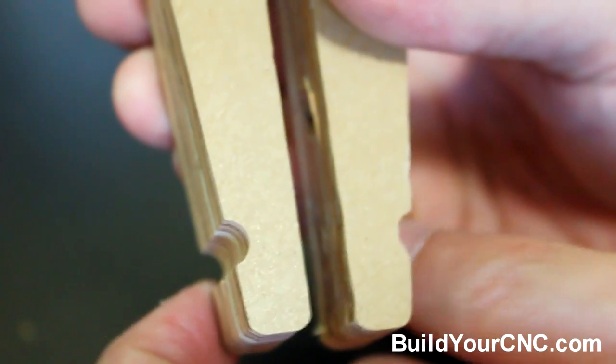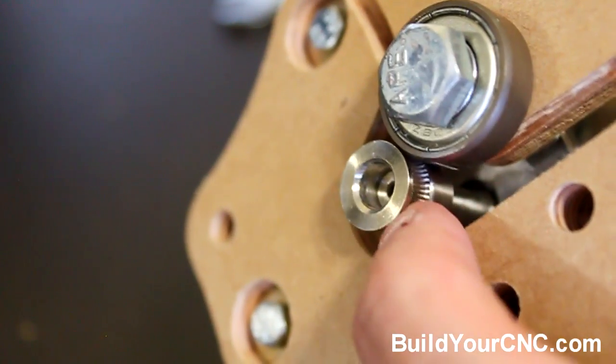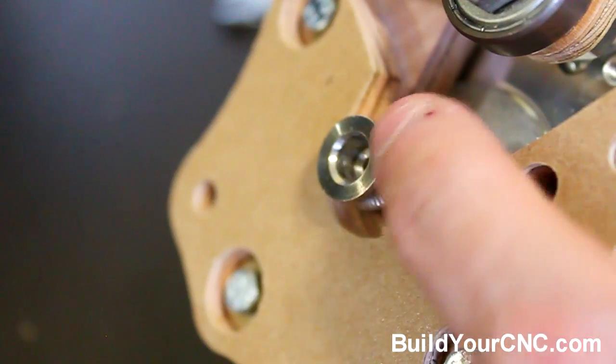This device will include these two depressed areas, or grooves, and that's used for a rubber band or some kind of tightening device. You can also drill a hole right in the middle all the way through both pieces and use a screw and nut to tighten them down if needed. A rubber band should be sufficient since it's located all the way to this end, giving a lot of torque or force between the bearing and the serrated hub. It's really only needed to grab the PLA or ABS and push it into the extruder.